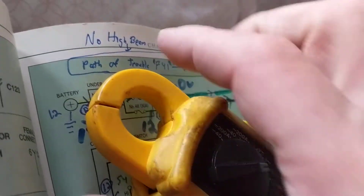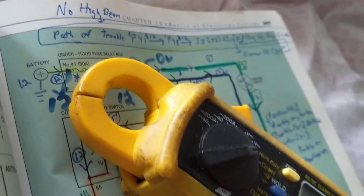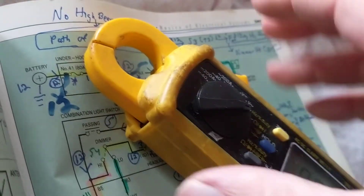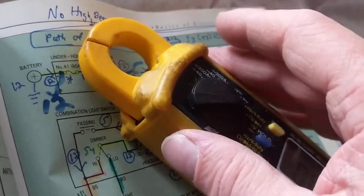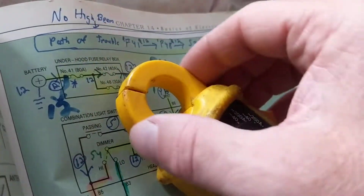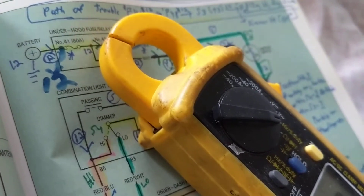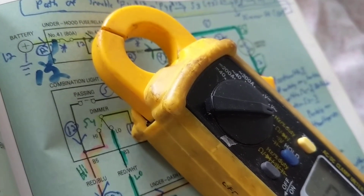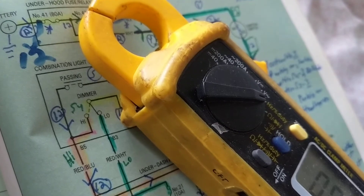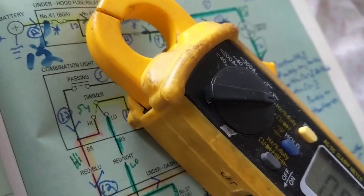Number two: pay attention to the jaws of the clamp meter. Make sure they're small enough. For electrical AC three-phase work, jaws can be much bigger, but for automotive use where everything is cramped and narrow, you need the smallest jaws you can find to fit around the wire. Please see my videos about how to measure alternator current, available on the channel 'Joe Electronics Schematics for Auto and Automotive Electronics by Joseph.' Thank you to the subscribers and enjoy the holidays!